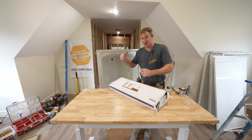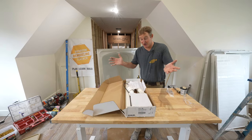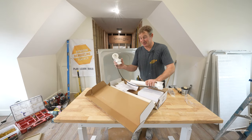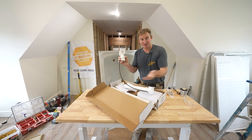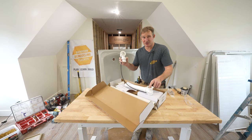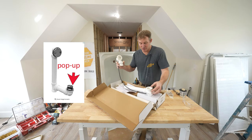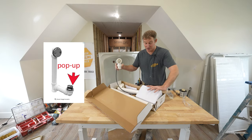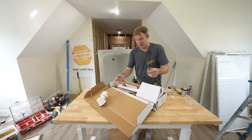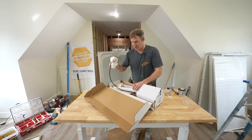Setting the tub assembly before you set the tub into mortar makes everything a lot easier, especially if you're doing this by yourself. We're going to be installing a Kohler cable-driven drain assembly. I really love these cable ones because it takes all the messing around with the mechanicals of a traditional drain. I also don't particularly love the pop-up drains because they end up breaking over time. These cable-driven ones are really well built. It basically just has a little drain that will pop up by use of the cable — in my mind this is a much stronger, longer-lasting drain assembly.